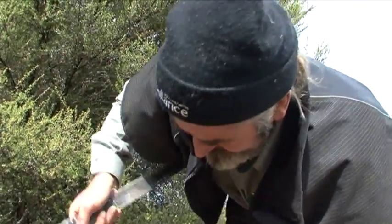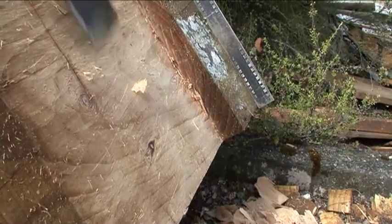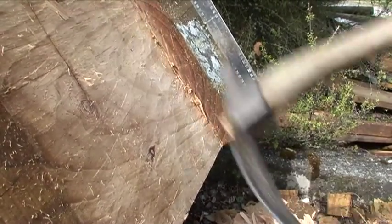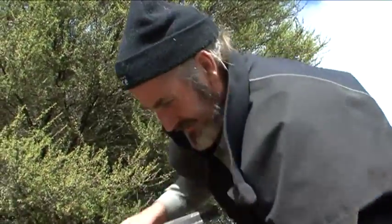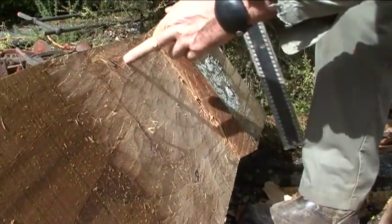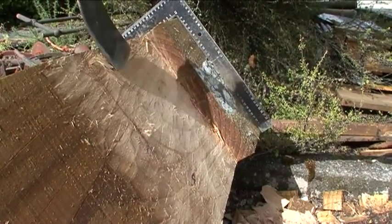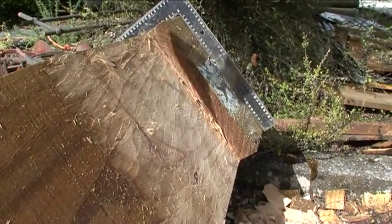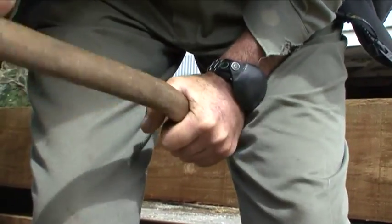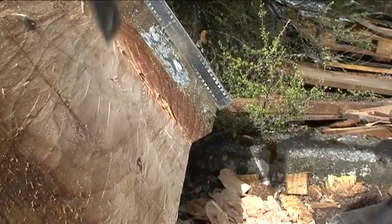And then down here you'll see the other lines there — we're just going to cut in through and cut that section down there, so I'll cut in from where it's low out here, and then cut back through on the angle, cross grain all the time with adzing, so that you're cross-graining it. When you reach it, run it through — only high spots up here. Cut it down again. I've adzed the line through up here, so anything that shows inside of here is high.